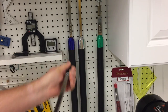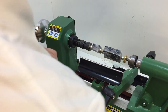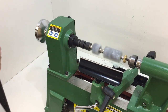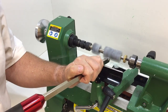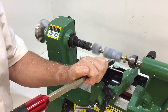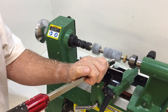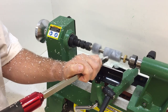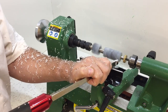I reach for my Simple Woodworking wood-turning tools — 'Simple' is the brand name. I bought them myself so this is not a paid endorsement, but I love these tools. Number one, they're carbide-tipped so they stay sharp for a very long time, especially when working with resin. Second, they are solidly built and the handles are color-coded, so even if I leave the cap on to protect the tip I know which tool I'm grabbing. You can see we're taking light passes — no reason to be particularly aggressive when turning pens.